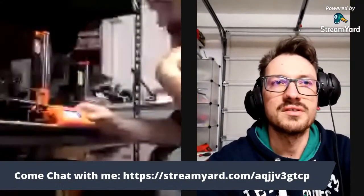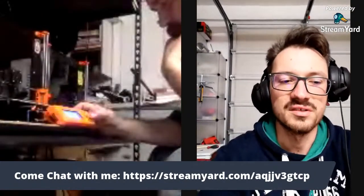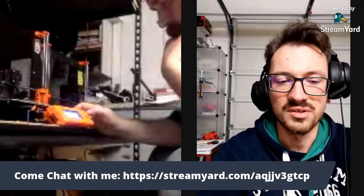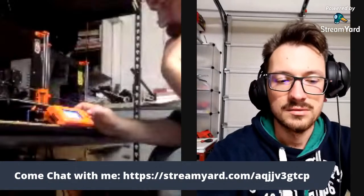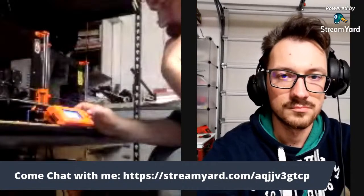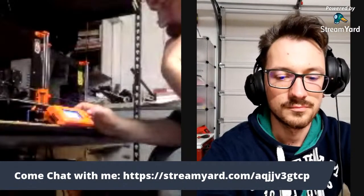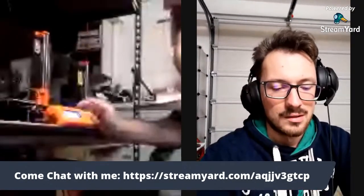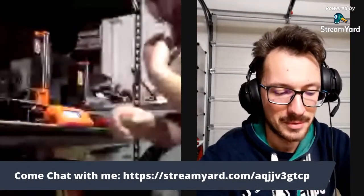Can't you print it? Maybe source it out to print it in higher temp material like HIPS or carbon nylon or something like that? I mean, PETG is pretty high temp material. I tend to print it around 250, 260. The thing is, I am printing PETG with these, so I really want something that is higher temp even than that.